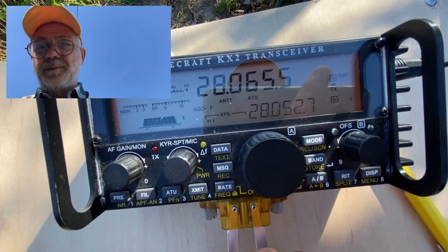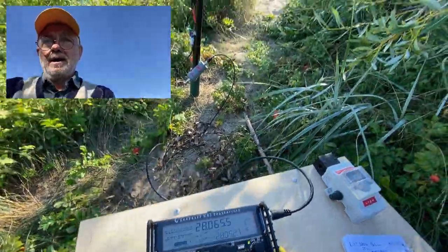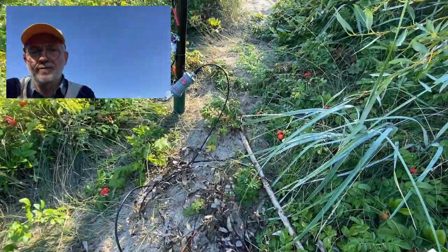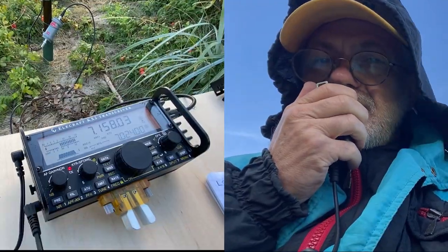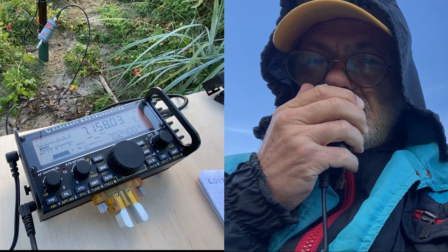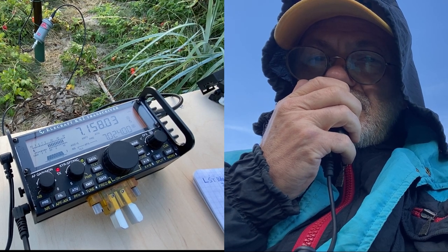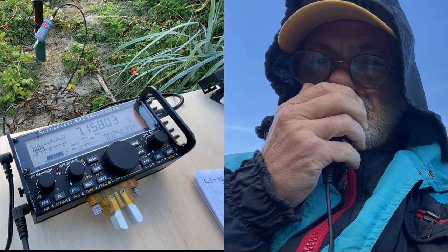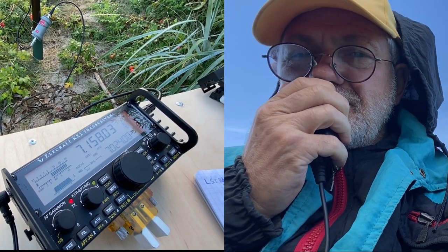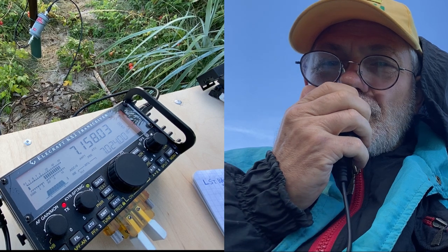On the 12-meter band — 1:1 again, perfect. On 28 MHz, the 10-meter band — and yes, 1:1, perfect. I'm amazed. The Elecraft KX2 automatic tuner tuned the W3EDP Junior antenna on all bands. I'm calling CQ as LY2H stroke portable. I made contact and reported testing a new antenna for my YouTube channel. 73, contact confirmed.